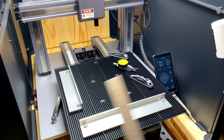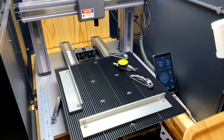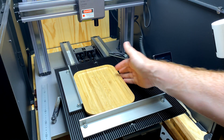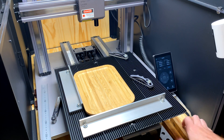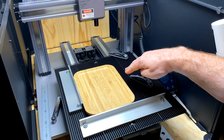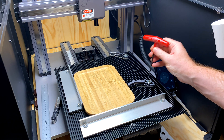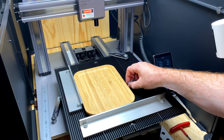These fences will change your life compared to the silicon plugs - you can do jobs fast, accurately, and repeatedly. I've got a lunchbox lid here, I can just drop it into the fences and it's already true - running within 0.02 millimeters. These clamps are just the standard CNC clamps flipped and stacked with some nuts and bolts to make a nice little clamp you can move around. You tighten it with an allen key when you're happy with where it's sitting, and I put a couple of rubber bands around the perimeter to give a bit of compression and help bite into the material.